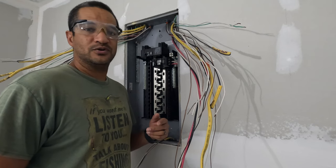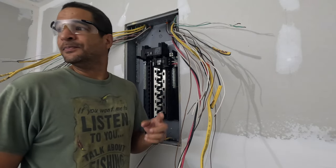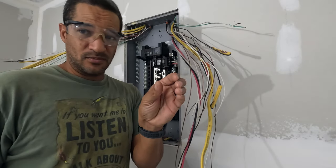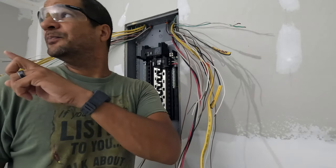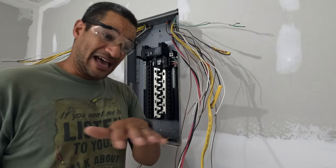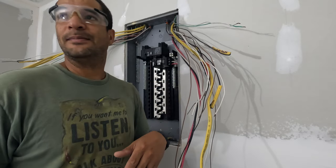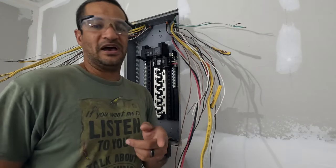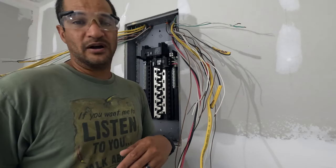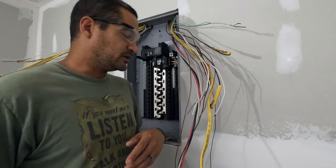The remainder of the trip — today and tomorrow — I want to float out some more mud and give it another day to dry. The corner beads are giving me a headache. I also want to start on the bathroom — put my curb up, and if I have time, put my first dry pack layer down for the shower pan, then the liner, then another layer on top. I also want to do the concrete pad for the mini split air conditioner outside, and build some garden boxes since we're at the end of August.